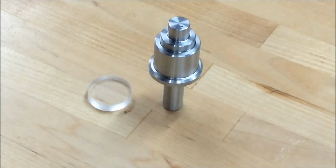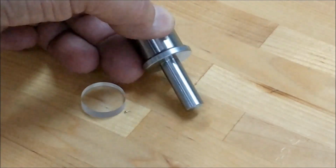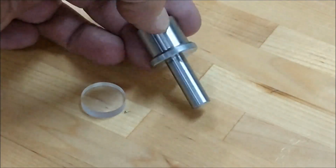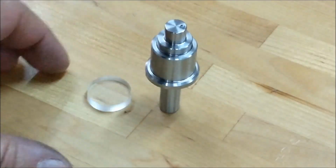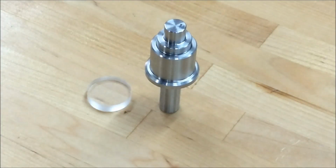Make sure you use 2 bearings if you do this. 2 will maintain an axial alignment. 1, it can still whip a little bit. Make sure that you follow the guidelines that I laid out when I showed you the assembly and the parts on the bench. That way it will be the most rigid and do the least amount of damage to the chuck you use it in.